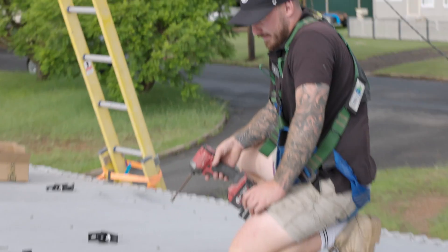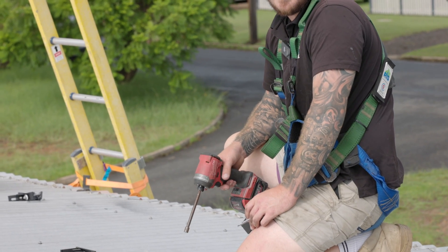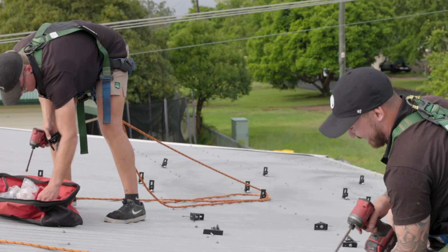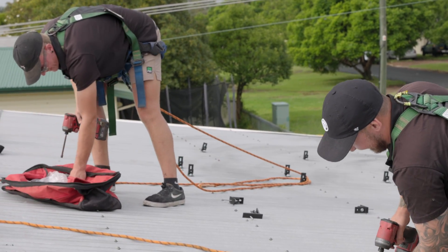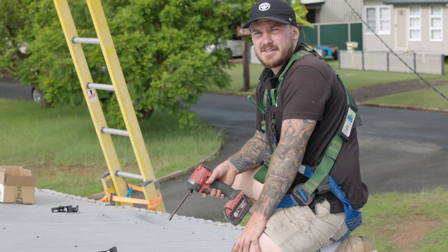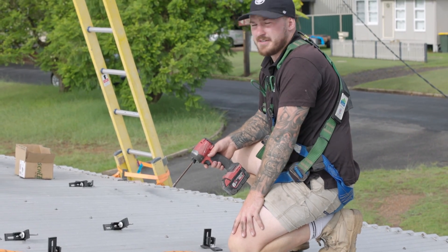Today it was a timber frame, so the timbers weren't too messed up — I took the screw out and drove a bigger screw in. Depending on the material, if we're going into metal we'll try and make a new hole because the hole gets blown out so much and it doesn't grab too well. It just depends what material we're drilling into. Today's nice strong hardwood.